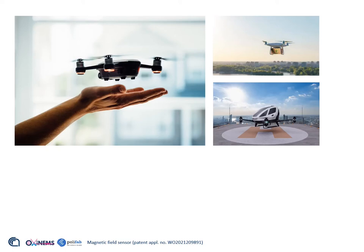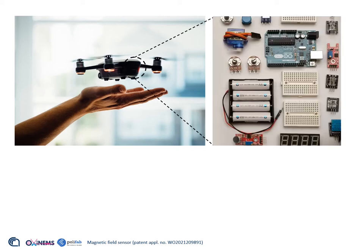We all know this object. Drones are now part of the consumer electronics, and in the future they will play an important role in logistics of goods and people. Inside a drone there are tens of sensors which are needed for stable and safe operation. One of the most important sensors is the e-compass. Together with the GPS, the drone uses the e-compass during navigation to compute its spatial orientation by measuring the Earth's magnetic field and gravity.